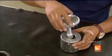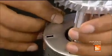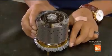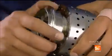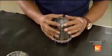He now holds the base plate unit above the combustion chamber, while he inserts the tiny fuel delivery tubes into the chamber. He flips the chamber around to slide the tubes further inside and complete the job. The stator vane, pressed onto the other end of the chamber, will redirect the flow of gases to the turbine wheel.